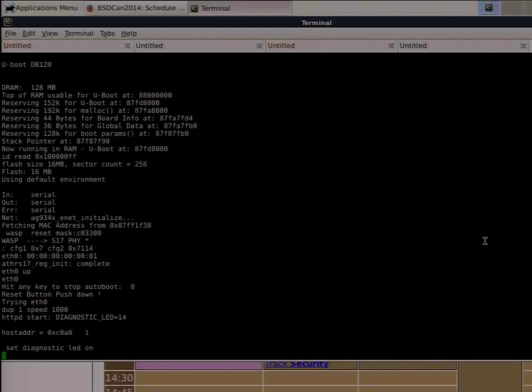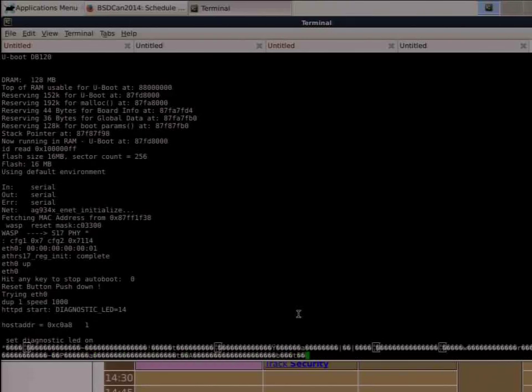Okay, so now, if I've connected. Nope, I sure didn't. Hold on. And now, you can't do anything. Don't accidentally plug in the 3.3 volt either. That will... Okay, no. I had the ground and the transmit reversed. Hold on. One would think that at this point I would have labeled all of the pins. You can get wired to it. All right.